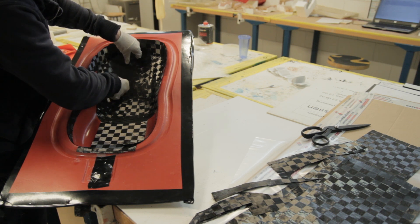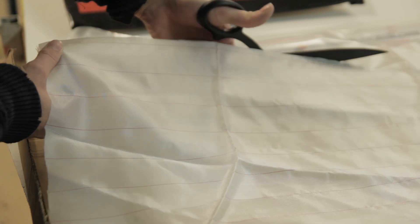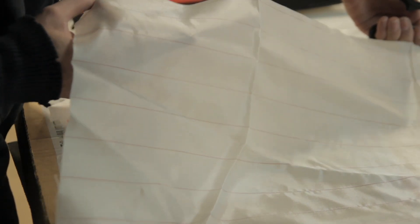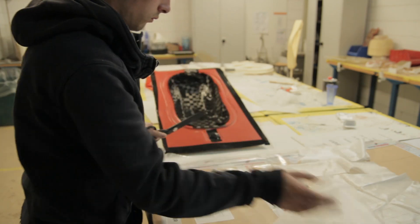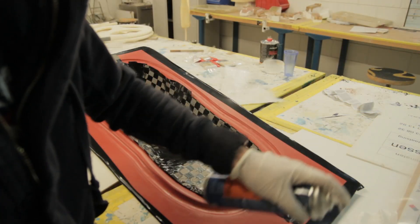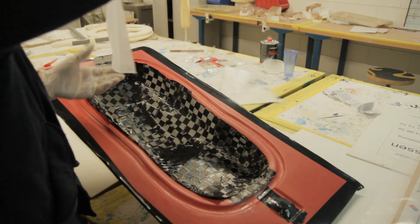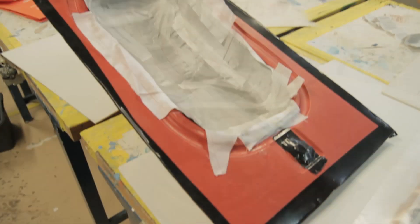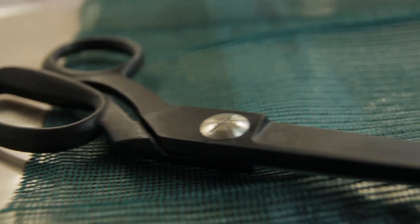As the process went through, I added a few patches of Techstream. I used one square meter, so that's not very much — I just wanted to test the cosmetic look of the finish. Here I'm using peel ply to remove all the vacuum supply coming on top. I've also read on the Techstream website that adding peel ply enables a better vacuum flow through the parts, providing fewer pinholes and air bubbles. I'm adding the peel ply with spray to have a nice tight fit against everything.